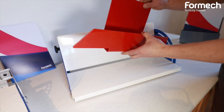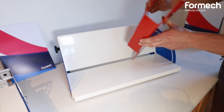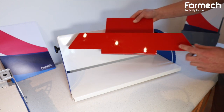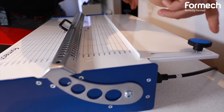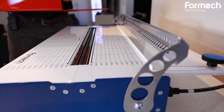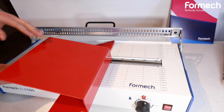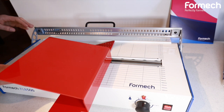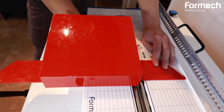Now we will remove the second bend. It's finished. It has cooled. We're going to form the side pieces. I need to readjust the material stops. I cannot use the material clamp to hold the pieces down as my previous bends are in the way of the clamp.